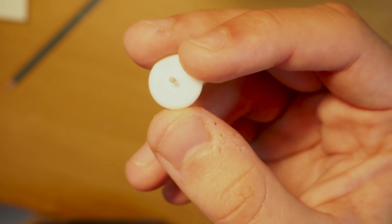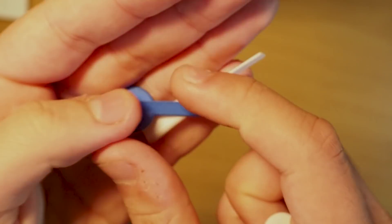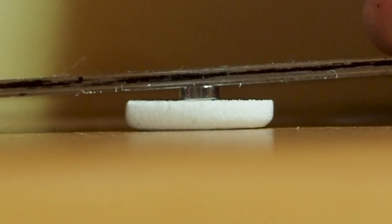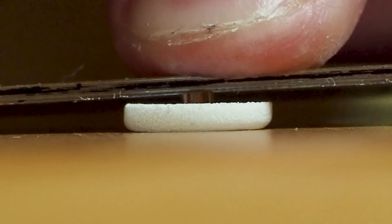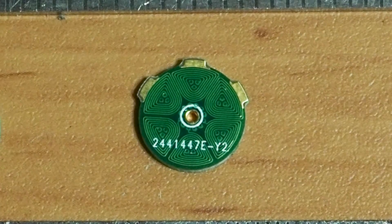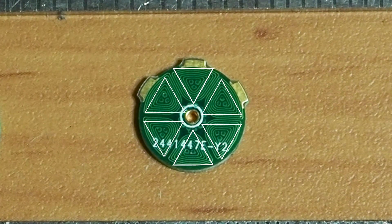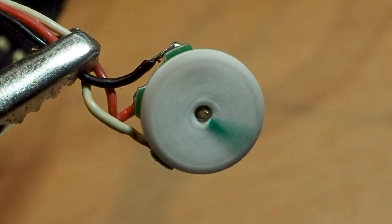The second reason is that I don't actually need the shaft — this depends on the final application, but customizing the tip into the rotor makes much more sense when you're working with things that are this small. So now I've mounted the bearing onto the rotor itself. The extra two layers of the stator increase the number of vias inside the coil to three, which forces the spiral coils to have a triangular shape — using the area of the magnetic field much more efficiently.